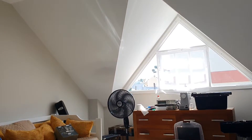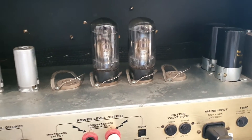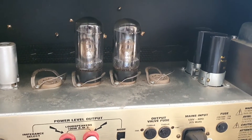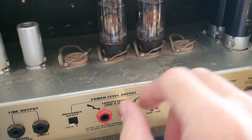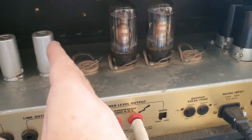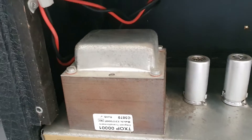Hi there, nice sunny day in Curitiba again. Here I've got a Marshall JCM 900 and a customer has removed two valves, so he's using it as a 50 watt rather than 100 watt amp. I think that's perfectly okay - you can remove the two on the outside or the two in the middle, but you need to leave one on each side for it to work. It will work like this and produce half the wattage.